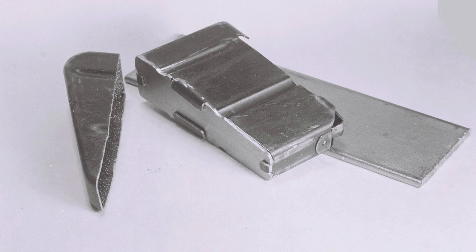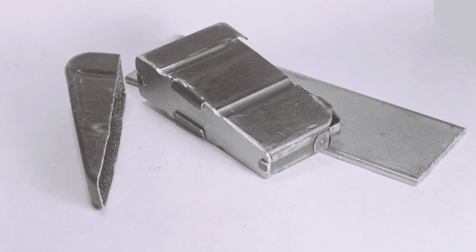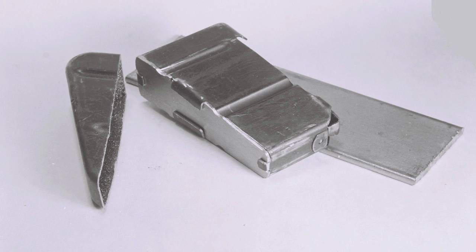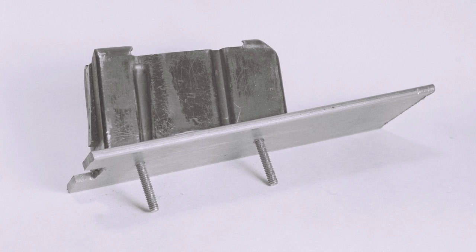I cut it off, and I leave 2 tabs of steel on the sides of the magazine. Then I make a new floor plate out of sheet metal, and I bend those tabs over to secure it and put the spring and the follower back in, and man, I've got a functioning magazine, and I make sure that it does everything it needs to do in the gun. And then the next step I'm going to take is to make a decorative floor plate for it, because of course it looks like crap right now.